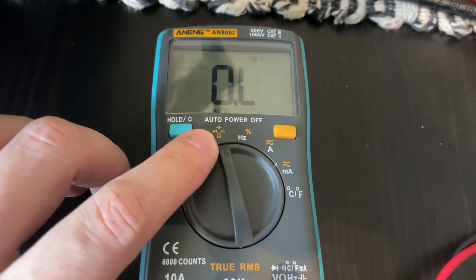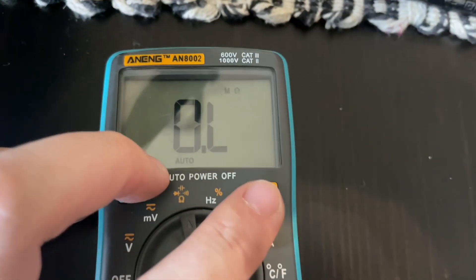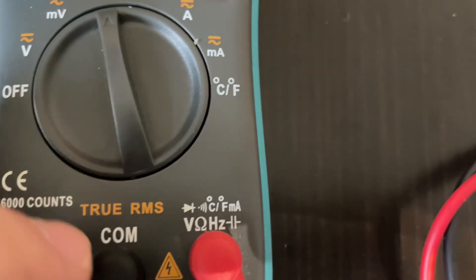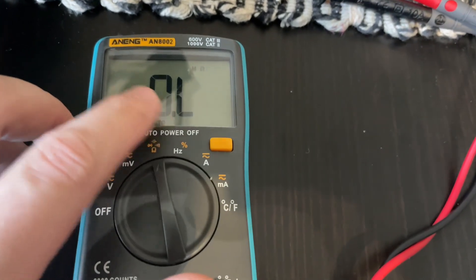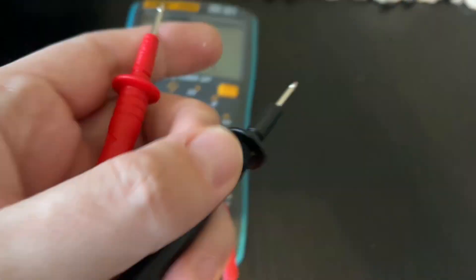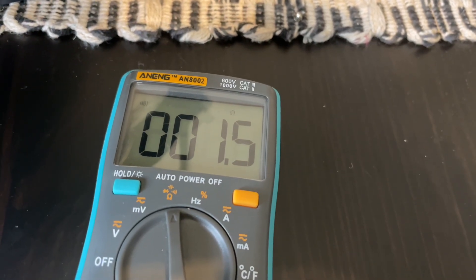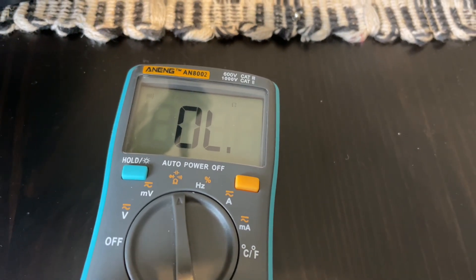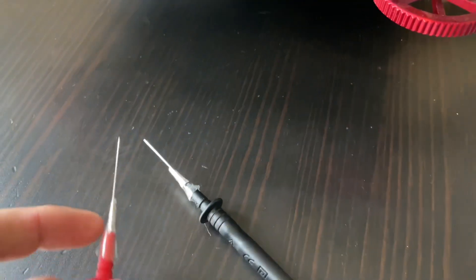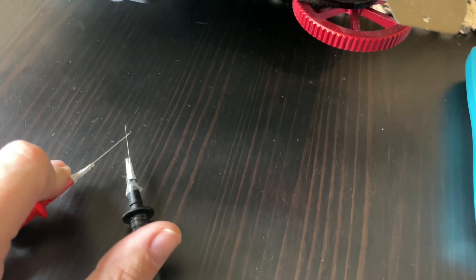If you've never used a multimeter before, all you need to do is set it to the ohm sign, which measures resistance — or in my case I'm using the continuity test, which is the little buzzer symbol. Make sure the probes are connected to the right ports. My multimeter will give a little buzz when the probes touch. Because the probes are too thick for the connector, just attach needles using duct tape or something similar, and make sure they still buzz when you touch them together.